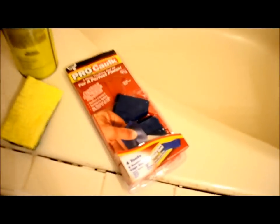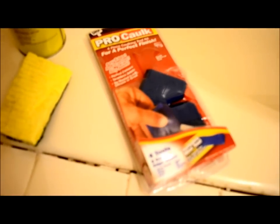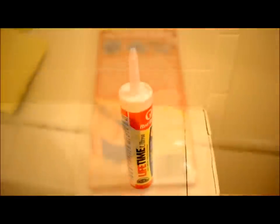We're not going to put a great deal on — just a little bit in the corner to spread. We're going to use these caulk corner tools, which are really like a soft rubber material that gives everything a professional look when it's all done. This entire set came with the removal tool and a couple of different sets of different radius dimensioned corner pieces, and it just makes the job a lot easier.